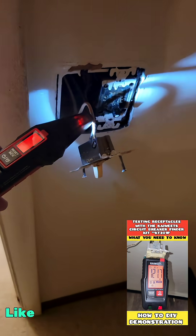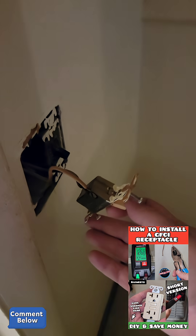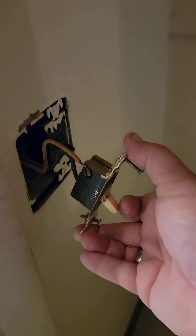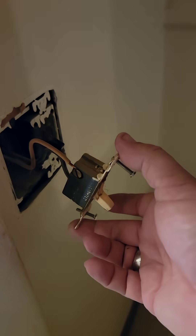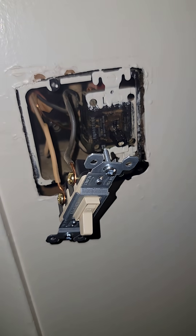This is a switch that lights up. I got the switch out — it's still plugged in and showing power is present. Moving it back and forth, the light's not coming on and the tester flashes. The tester did allow me to find this potential problem inside the switch, and we're going to go ahead and change it. Got a new switch installed, the Romex is coming down, and all the grounds are tied together.